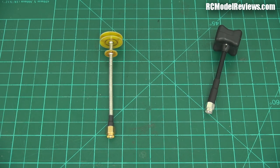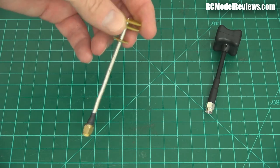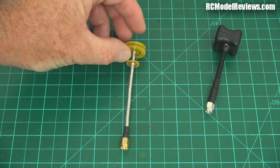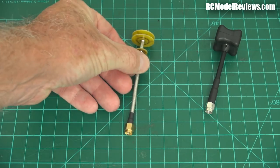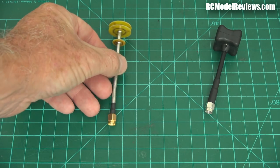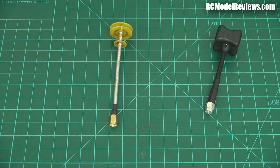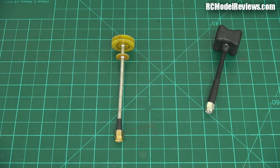So that's an important thing to look at — how you case them and what effect the case has. I'm going to fly mine naked. What I've done is just put a little bit of heat shrink around the top there just to hold those plates in rough alignment. Another way to do it is to put some kind of dielectric in there, but even if you put foam between those plates it will slightly affect the tuning. So perhaps Martin can run through the simulator with various dielectrics between the plates and see what changes might need to be made to support, for example, polystyrene foam or hard plastic, just to make sure it's tuned to the right frequency.